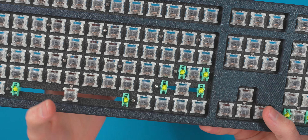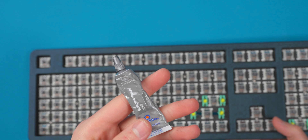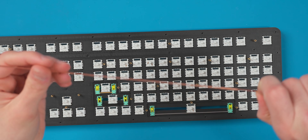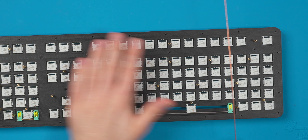All the switches are in the board. You can see I have these generic no-name AliExpress stabilizers in here. All I did was take some dielectric grease and put it on the bars to make them a little bit better. Now I'm going to flip this over and start doing the columns. I'll be using some straightened 16-gauge copper wire, cutting and wiring them all up, and then we'll talk about the rows next.